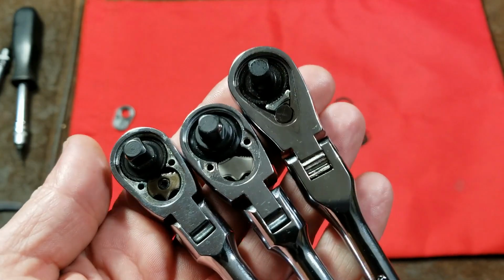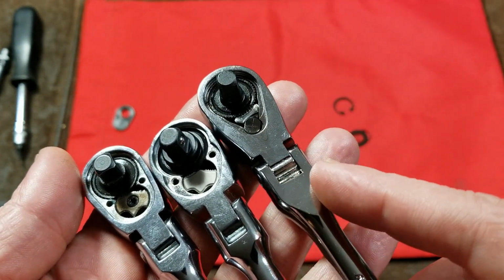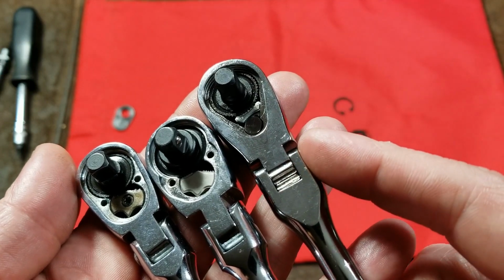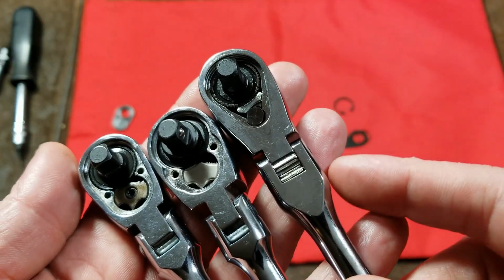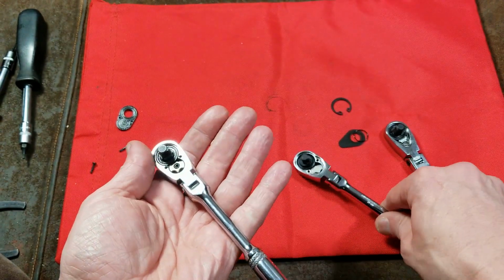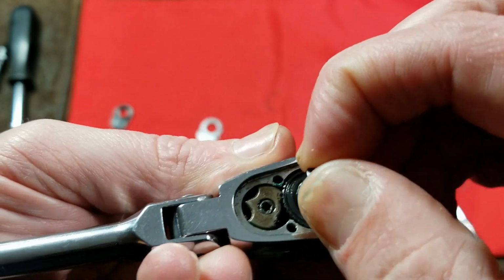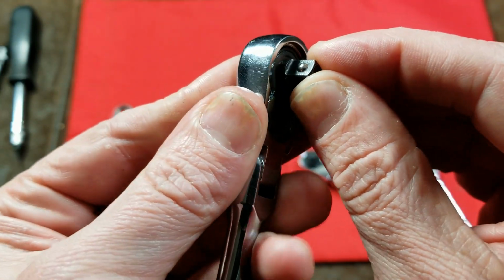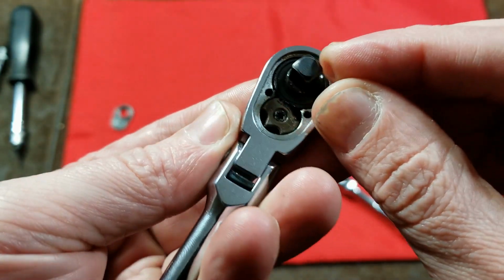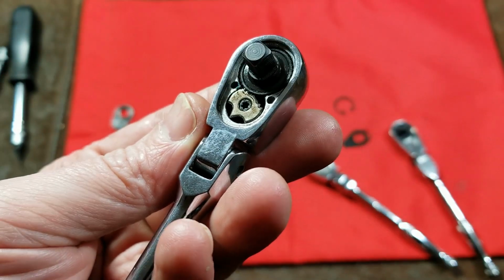having tight anvils is a big deal, and the reason I really criticize these new 100 tooths and gear wrenches for their wobbly anvils, because they use a split dual pawl design. When you have a really nice anvil, such as in this one where it's all really tight, then when you're ratcheting, even if you're in an awkward situation, pulling or pushing on it, you make sure that that anvil's nice and square with the teeth.